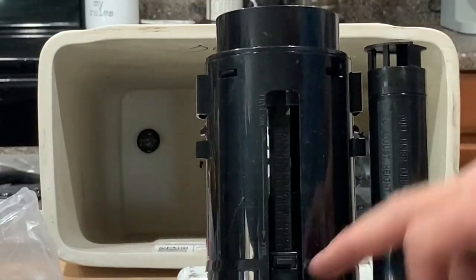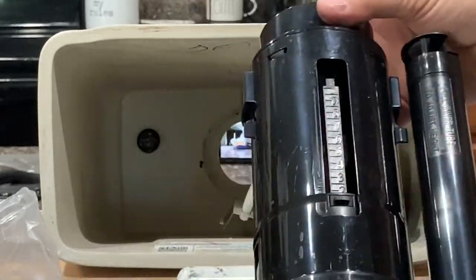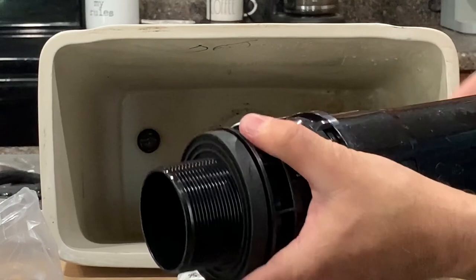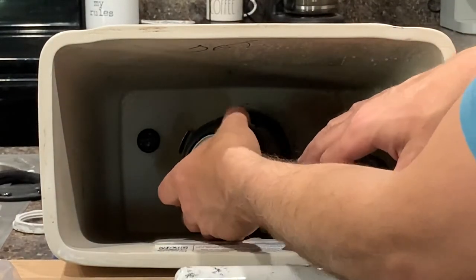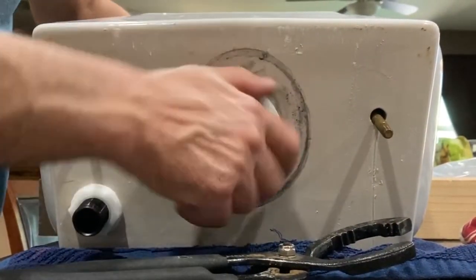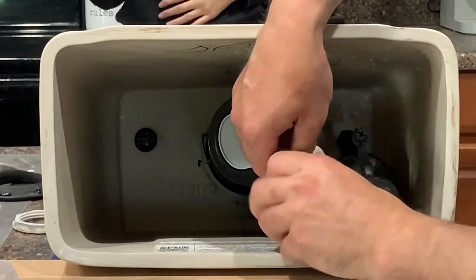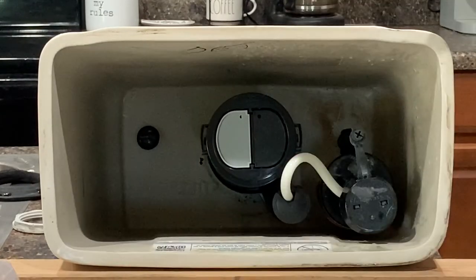This is the one I ended up getting off of Amazon and I have no quality concerns with it. Before setting the new one in the tank I played with all the adjustments so I knew how everything worked, including the half flush, full flush water levels, and the water height in the tank, to make those adjustments easier once it was installed. I made sure the rubber seal was on the bottom of the flush valve and then set it into place. Make sure you have it at the same orientation as before. I held the flush valve by hand on the inside of the tank while tightening down the nut on the bottom with the oil filter wrench or channel locks. The new flush valve just had a hole that was the perfect size for the fill hose, so I removed the clip from the old one and pushed the hose into place on the new valve.